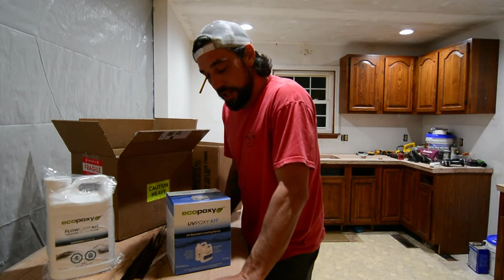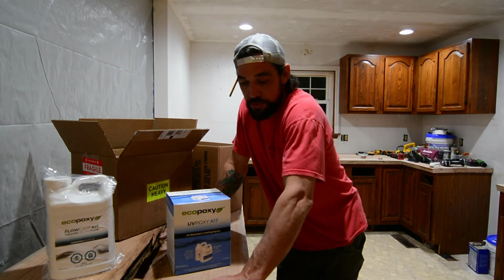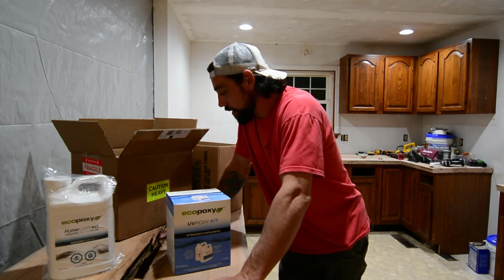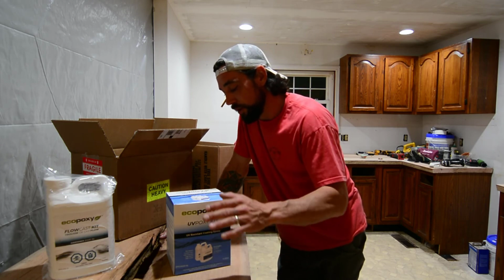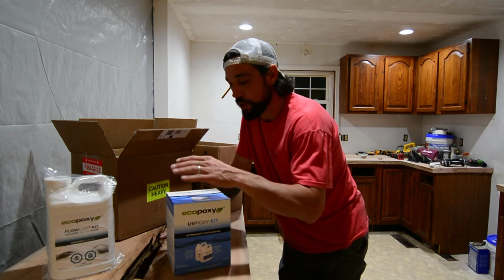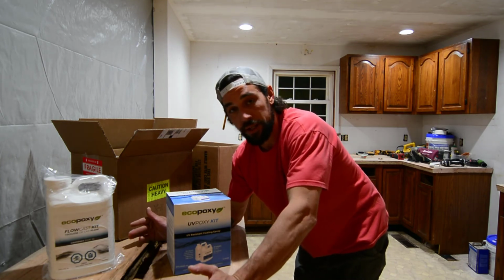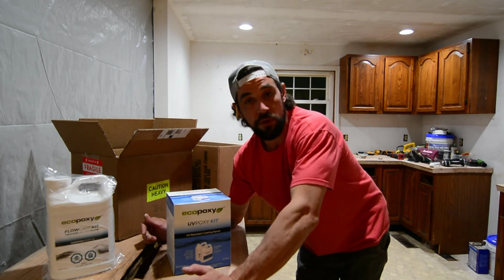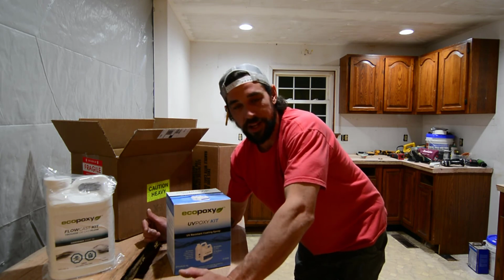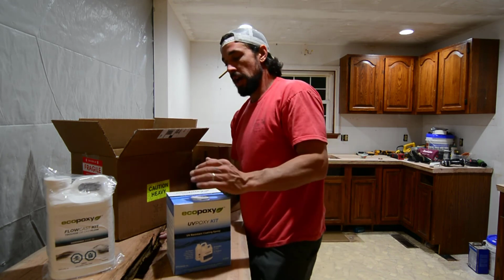And because we're doing the epoxy stuff on it, I'm gonna be trying a waterborne stain for the first time. We're gonna order some espresso stain from Minwax that's a waterborne, which nobody seems to carry, but that will allow us to go from the stain directly into our epoxy pour. So normally if you were going to do an oil-based stain, you would have to surface it with a polyurethane or a wipe-on urethane or something like that to seal those oils down before coming over it with the epoxy. So that will be the countertops.